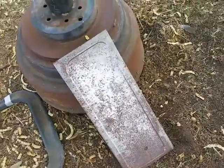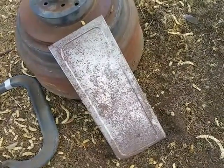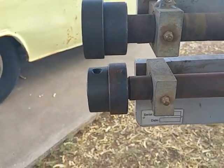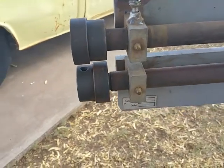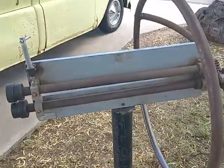Here's what you can do with the bead roller — it allows you to do inset panels in sheet metal. I just free-handed that one, eyeballed it with no reference marks. I did it with a pair of slitting dies; they're actually designed for cutting, but I opened up the gap far enough that they won't cut, so they do a nice inset pattern instead.